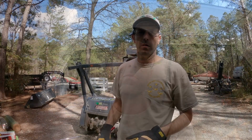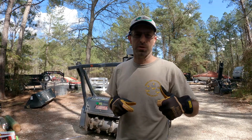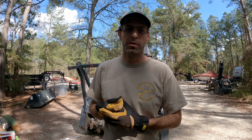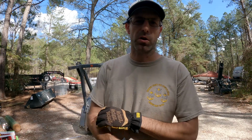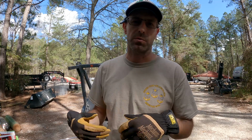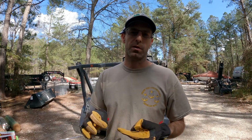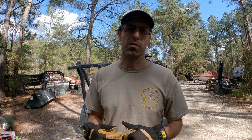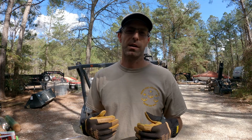Okay, we got all set up here. I got my oldest son Wyatt here with me to help me. So what we're gonna do is change all of these teeth. We want to put the existing knives back on. With these heads, one thing that's really important is balance, right? They spin really fast, you don't want them to get off. So we are gonna basically remove one tooth, number it, and lay it out in a pattern that way. As we work and when we come back from our trip and want to put the knives back on, we know where they came off of, hopefully.